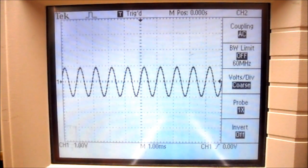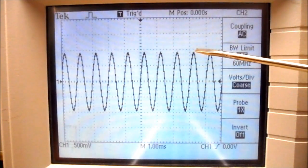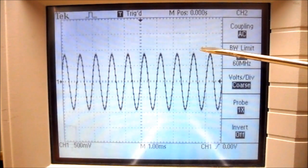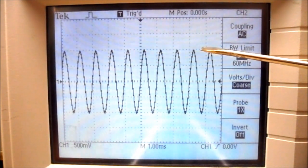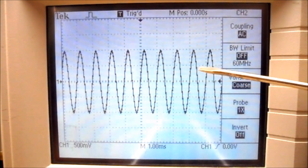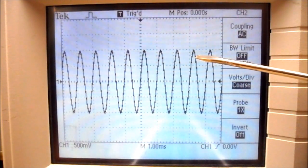Now I can change my channel 1 volts per division by rotating the knob clockwise one more click. I'm now at 500 millivolts per division. And I can adjust my amplitude to make sure that that waveform just touches the second line up. So that's half a volt, that's 1 volt. So we're trying to get a 1 volt peak sine wave.